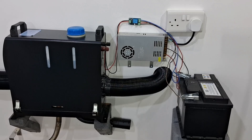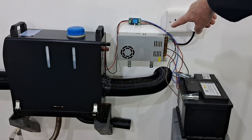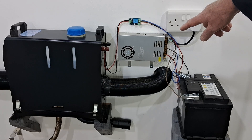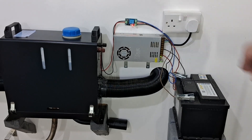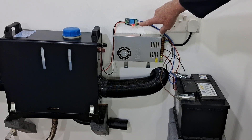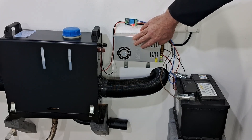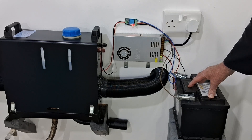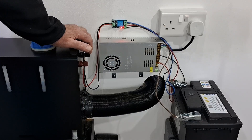Now for the next part. You've had your power cut — now what happens when the power comes back on? This is supposed to switch from the battery power back onto the 12 volt power supply, so we're going to try that now. The power is coming back on — there you go guys, that seems to have worked perfectly. The little power light's come back on, the automatic switcher switches to the preferred mode which is the 12 volt power supply, battery backup's gone off. And just to prove that, I'll disconnect the battery — and that's worked.